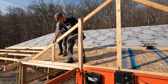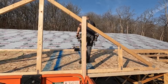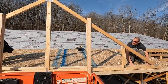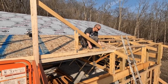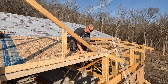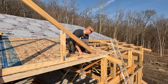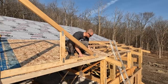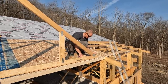All right, so that's got to sit right at that edge of the plywood. Grab our 2x4. Set it right up against it. Measure from your end how far down you are. We'll split the difference. So 12, 14, should be about 7 3/8. I'm 7 1/2. I'm at 7 1/4. All right, come my way, 1/8. Should be about 3/8 right there.